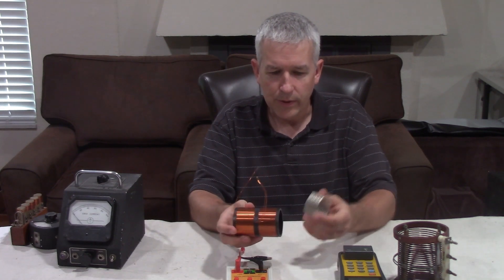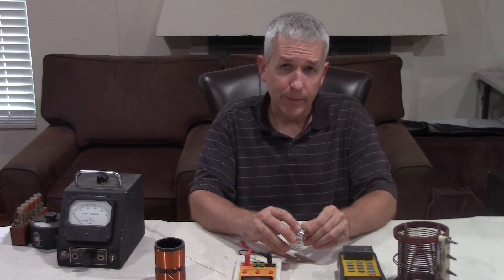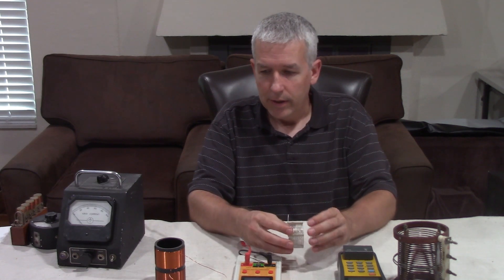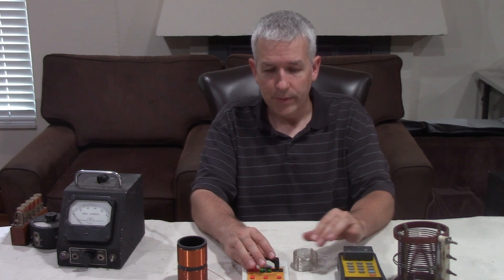These larger coils have more inductance than the smaller one. Basically that's what I wanted to touch on — we cover a lot of these things in the book, and you can look online at tutorials for more information. One way around using the LCR meter, besides the oscilloscope with the sniffer coil, is to use a coil calculator. Type in 'helix coil calculator' and you'll find a variety of websites.